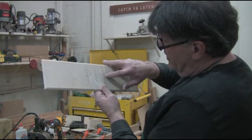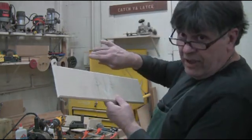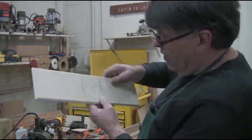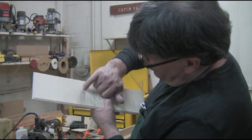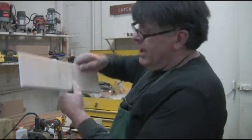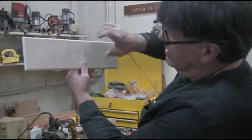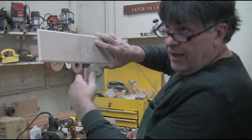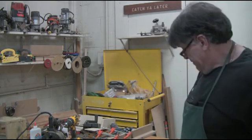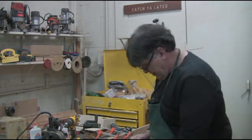And you can either do that and just drive the nail on in, set it and fill it even though it's going to be covered, or you can drill right at your point where you're going to be drilling for your hardware with a larger nail, put it in, and just drive it enough to keep the thing from moving. Then after the glue's dry, just pull them out. So don't complicate it. All right.